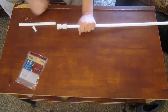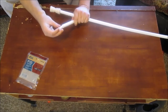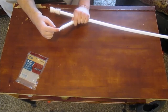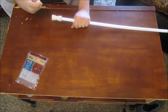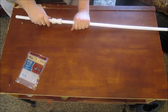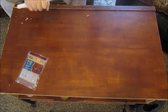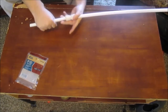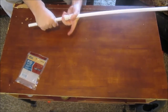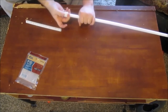Seat it. And the same thing, if you want to make a fitting connector connection and you're using PEX pipe, you got to use the stiffener. If you're using copper or whatever, you don't have to use these stiffeners. Slip it in, and that's that. You can't pull that apart. That's in there. If you want to take it apart, you simply grab it, push here, pull out. Push here, pull out.